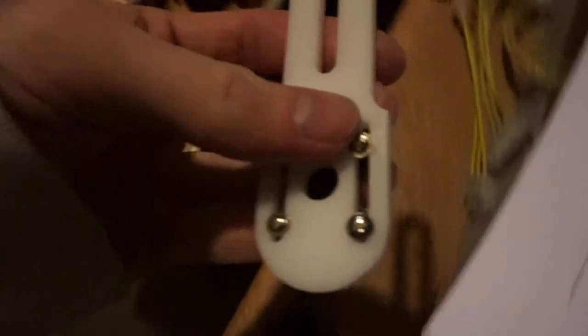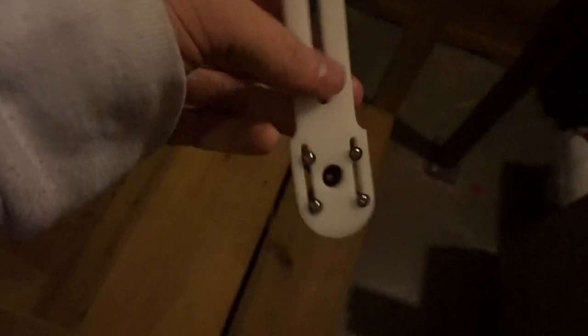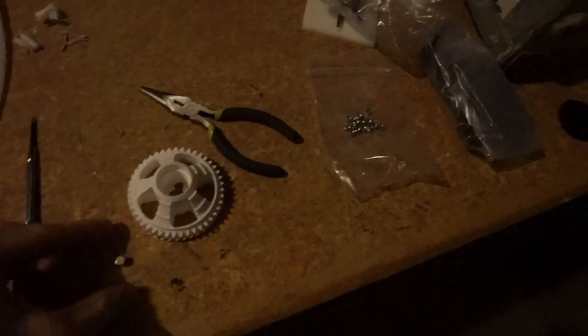So the next step is to take the servo arm and attach it to the guide arm board with the four Phillips screws, and then attach it to the servo so it can slide far enough to touch both sides. So now I want to get the magnet from the bag. There will be a dot on it which says that's the north side. So I'll put this in the back side of the gear cone. It'll be right here.